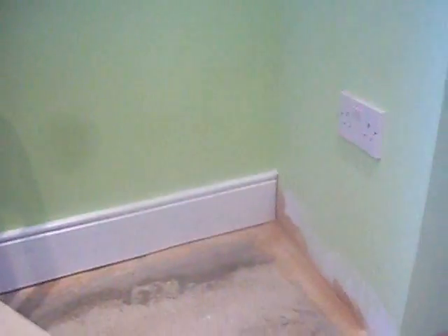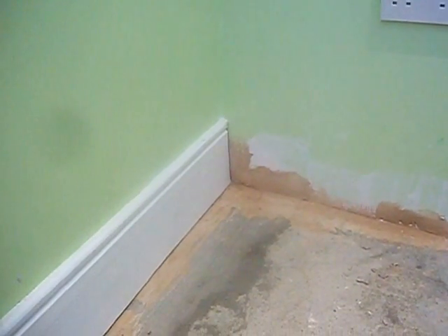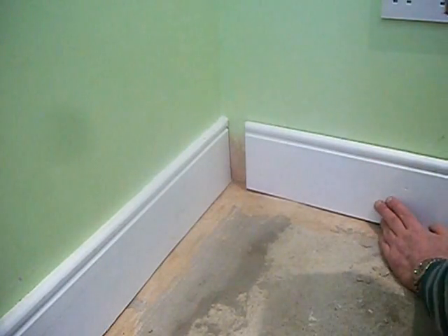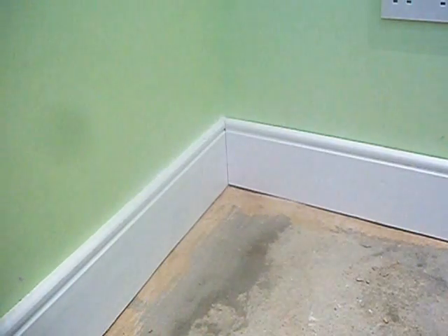When you get near the top you don't want to break that off. I wouldn't recommend holding your thumb up against the saw unless you know what you're doing, but it stops the wood breaking off. That's what you're looking for — the exact profile of the piece of skirting board that's already against the wall. Hopefully it'll fit — sometimes you don't get it exact first time and have to adjust.